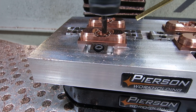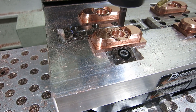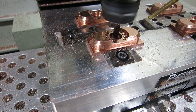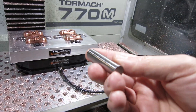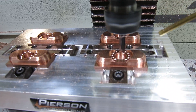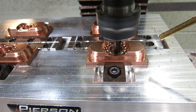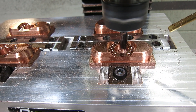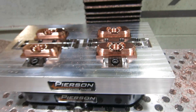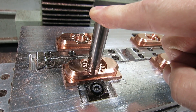Now I am starting the final operation for really getting that bearing hole just perfect. I cut it both clockwise and counterclockwise. Then I use what is called a pin gauge to see if the hole is the right size. If that pin gauge doesn't fit, I mill it out two thousandths of an inch more and check it again — I keep doing that until my pin gauge slips in perfectly. You can hear a pop when I pull it out, and that is how I know it is where it needs to be.